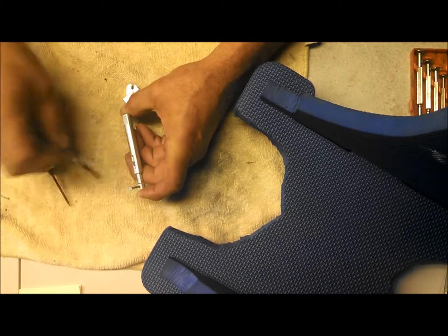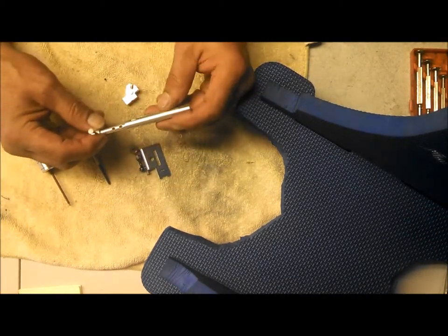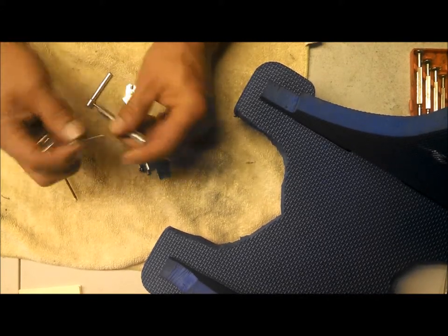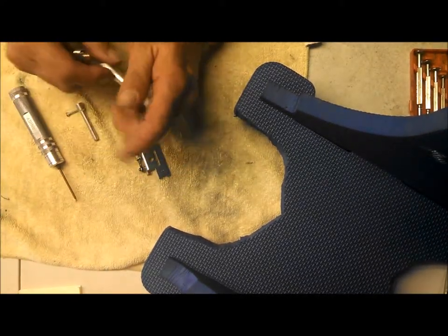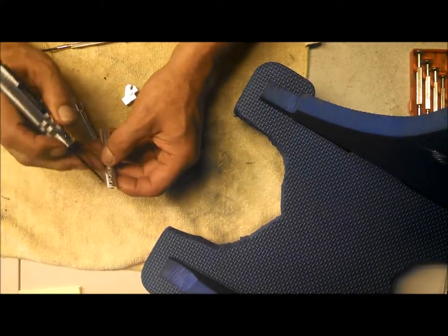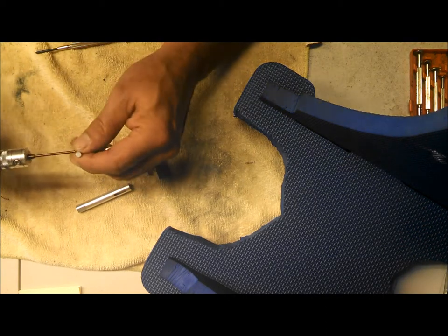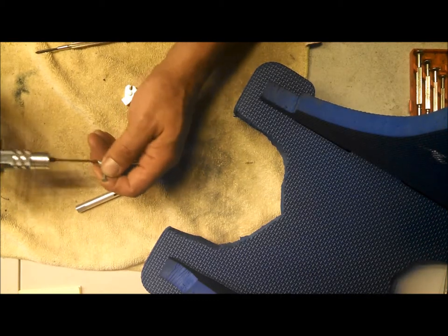So I'll go ahead and do it since I'm going to drill this out - I don't want all those chips getting inside there. I'm going to simply remove that screw, put it aside so I don't lose it, and take it apart. There's the spring - I had the cut end in and the flat end out, so it sits nice and firmly and doesn't bind. If we're going to drill this out, you also want to remove these two grub screws.